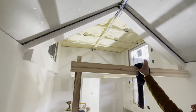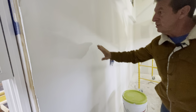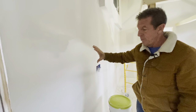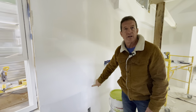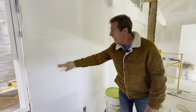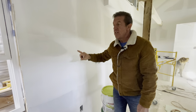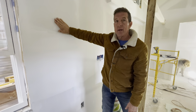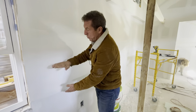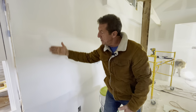So imagine having a wood ceiling and sheetrock walls. Just to point out a little about sheetrock mud, which we call mud or finishing. You have almost a 24-inch spread. There's only one crack in here, where two pieces of sheetrock were put together. This is a seam. It's thicker here, and it's feathered to nothing here. With one little crack, he's had to spread it out 24 inches.